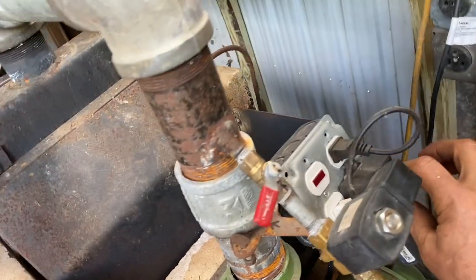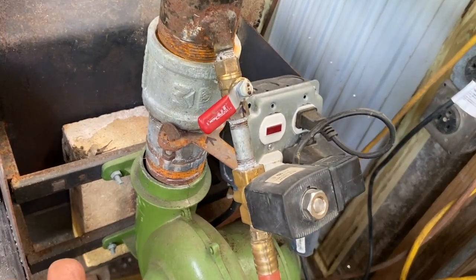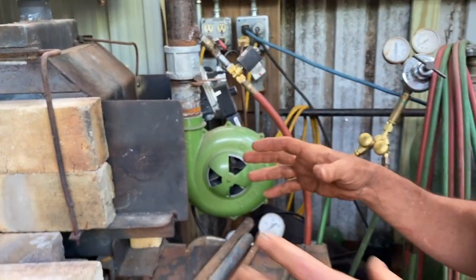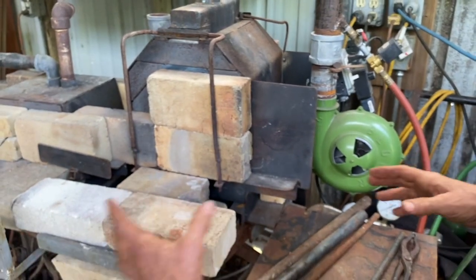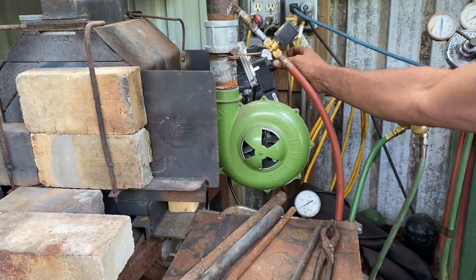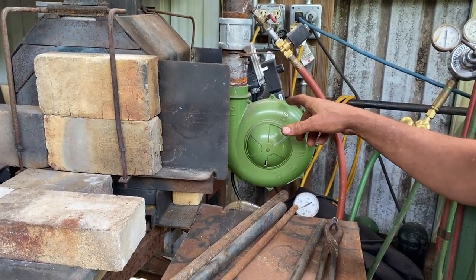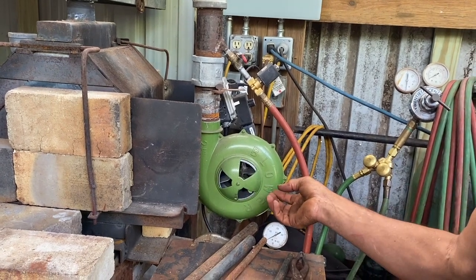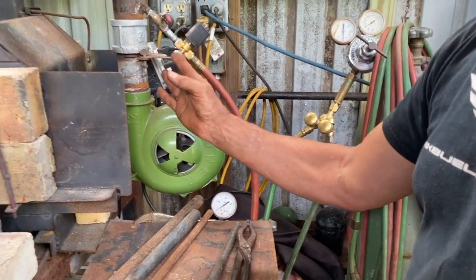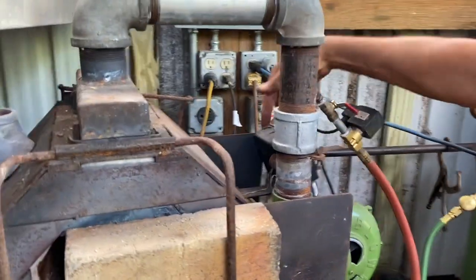So you've got your fan speed that I can increase or decrease, and the more air you put into the chamber, the more it has to exit. So keep that in mind, because you'll have what's called the tail of the dragon coming out here, and it'll make it difficult to forge around. So you may want to play around with how much air you put in there. You can play around with it here, but here I find that it will bog down your motor. So I think it's important to have that open. And although this is choked here, it's got a pipe that's open up here. And so if you can, there's a pipe right there.